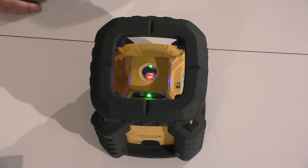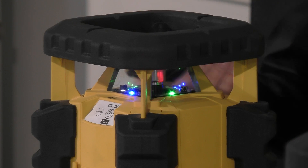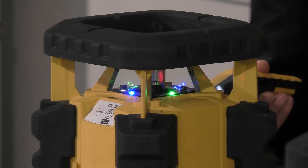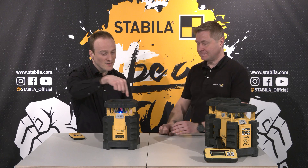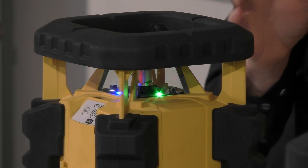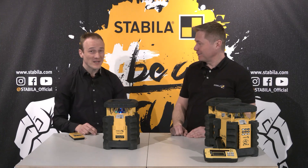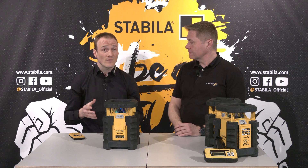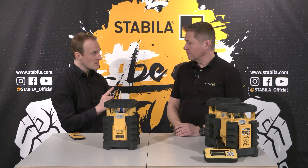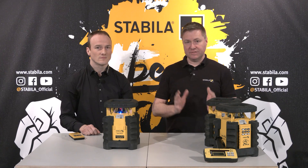So I have a clear assignment of axes. In addition, I'm also notified when the laser has experienced a movement and there is a risk of incorrect measurements — the laser stops directly and the white LEDs draw attention to this. As you can see now, all the LEDs are flashing, showing 'something happened to the laser, please look at it.' You can see it from a long distance. With that I can check the leveling and put the laser back into operation. LED Assist also shows the battery and temperature status — to sum up, it gives easier operation, increased work safety and time savings.